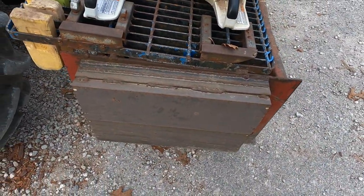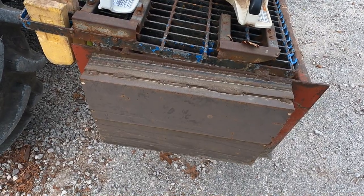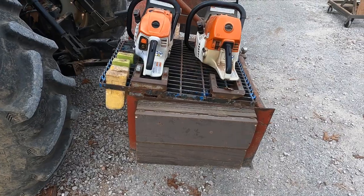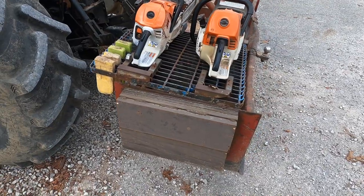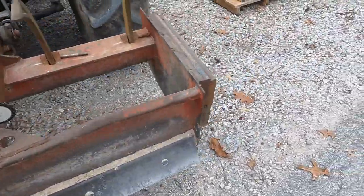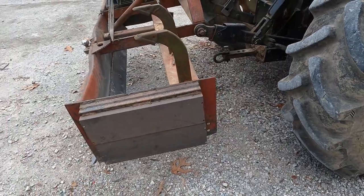I've also got several hundred pounds of weight plates welded on to the end and sides of the box. Most landscape boxes are way too light — you've got to put some weight on them. We're talking shear steel. They only dig in if they have mass — they can't float. We've got big weight plates welded on this side too.